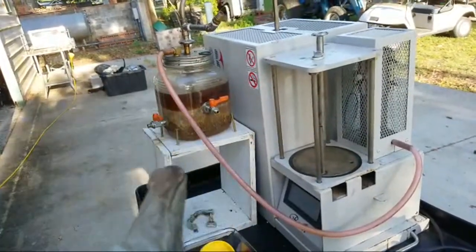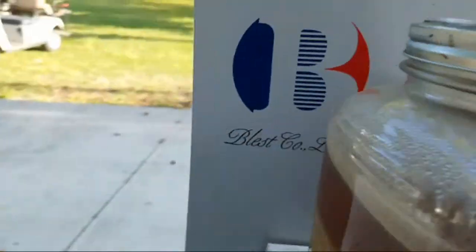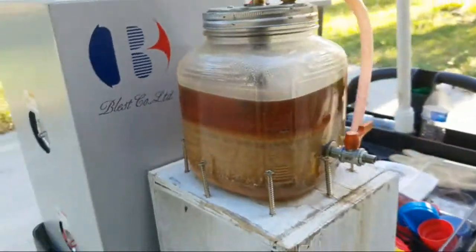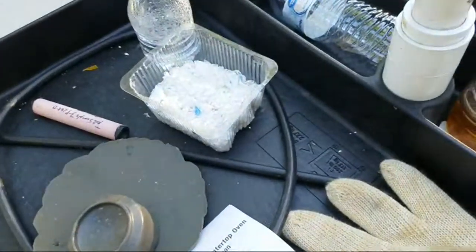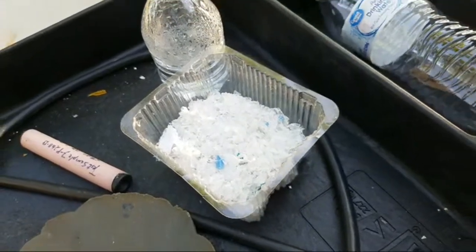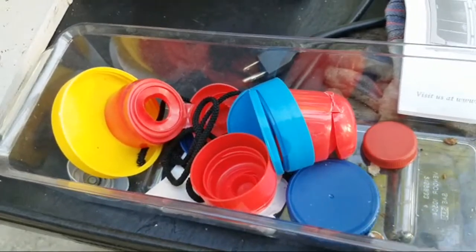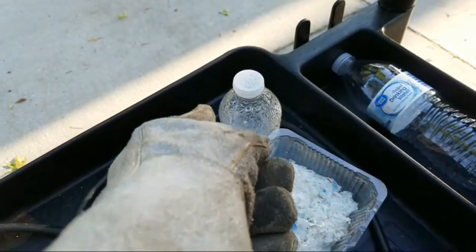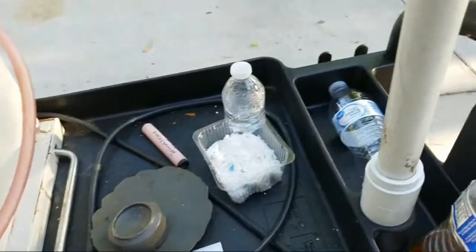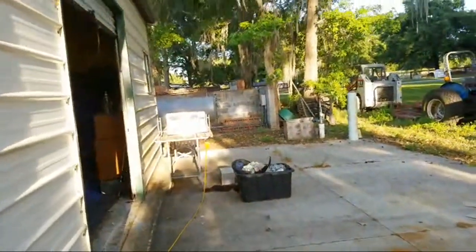To clarify temperatures: over with that oven we were at 450 Fahrenheit, which is about 230 Celsius. This machine gets up to 450 Celsius — that's like 890 degrees Fahrenheit — and that's what turns the plastic back into oil. This is the Blest plastic-to-oil machine from Japan. We use it for a kilogram a day of number six polystyrene, number five polypropylene, number two high-density polyethylene, number four low-density polyethylene — not number one, not polyethylene terephthalate or PET. Not that at all — the cap yes, the bottle no. And not under any circumstances PVC number three, because that produces furans and dioxins and is toxic.